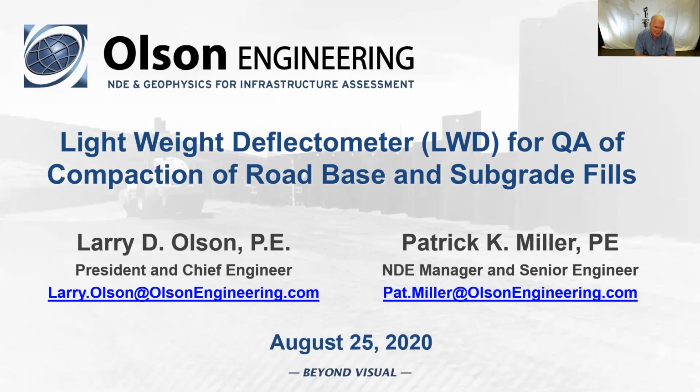Today's topic is on the lightweight deflectometer for quality assurance and compaction of road base and subgrade. So this is like a lot of things, a 30-year-old newer device that is now starting to be used more in the United States as people are getting more interested in changing from the nuclear density gauge compaction quality assurance approach to lightweight deflectometer for the simple reason that modulus and stiffness matter.